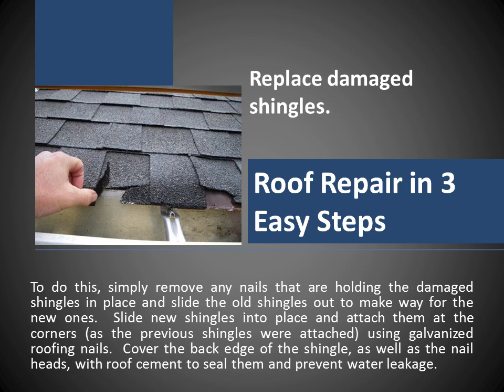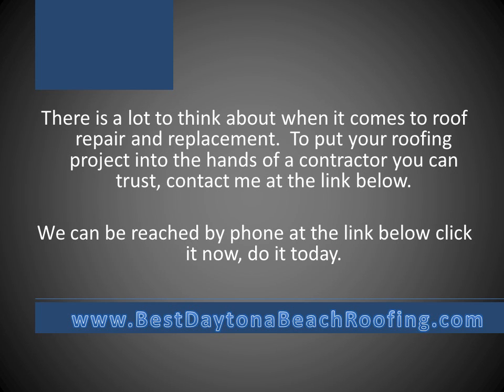Slide new shingles into place and attach them at the corners, as the previous shingles were attached, using galvanized roofing nails. Cover the back edge of the shingle, as well as the nail heads, with roof cement to seal them and prevent water leakage. There is a lot to think about when it comes to roof repair and replacement.